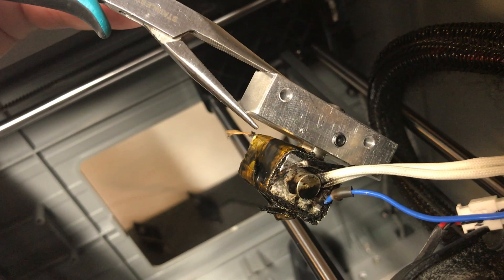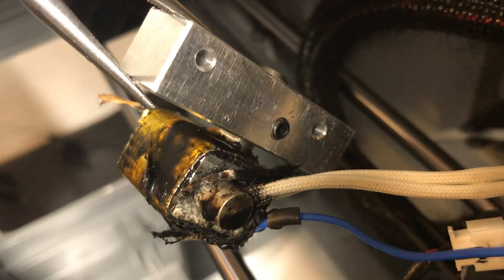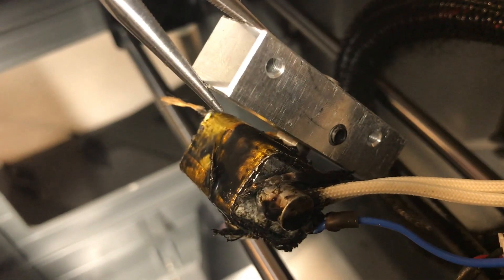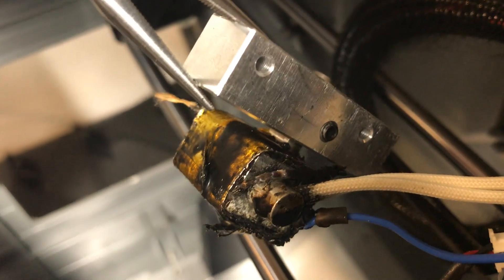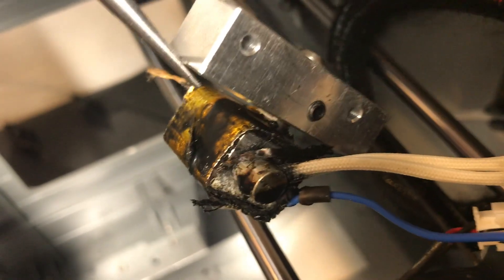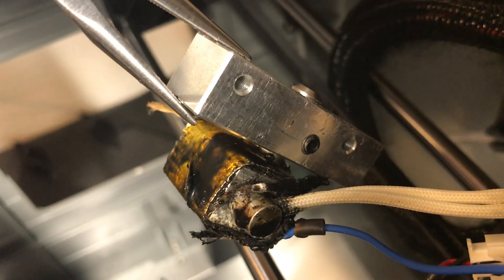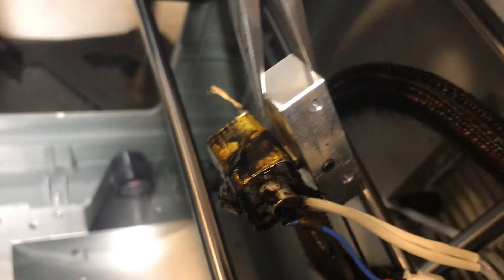After it's been heated up and cleaned off just a little bit, there is a set screw in the back of the block that you're going to have to loosen — which is lots of fun. You have to wait until your hot end cools. I loosened the screw but the hot end isn't cool yet, so let me set it down. Don't set it back on the plastic or you'll get some melt. Set it on something metal to let it cool down — it takes about 20 minutes.